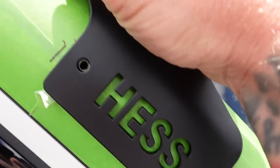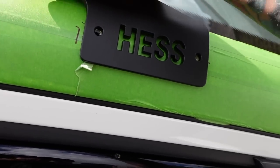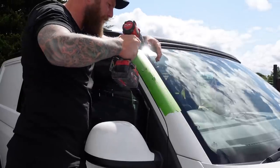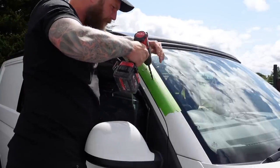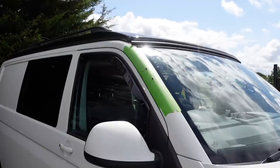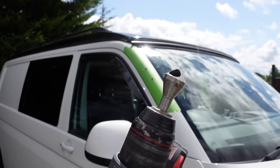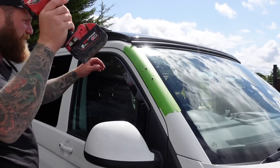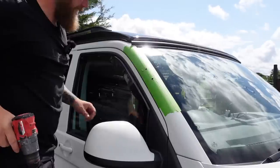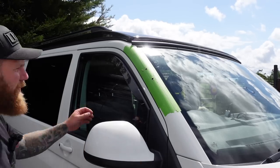Hopefully you can see — they are lined up lovely, parallel. Let's go for it. Now that's started and can't move around, I'm going to come through with a 9.5mm bit. That's going to leave some pretty horrible edges, so I'll use one of these — I believe they're called a rosebud — to clean that edge up.